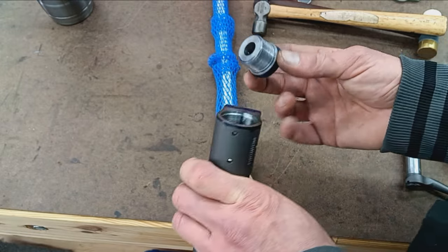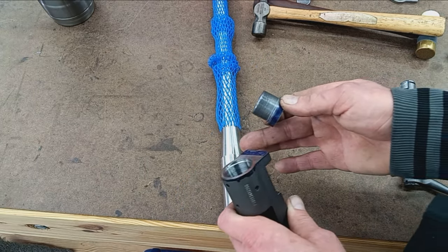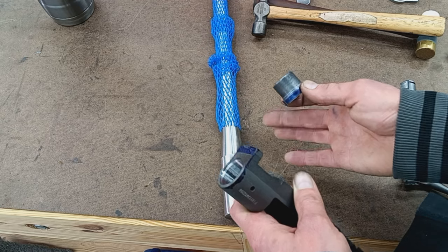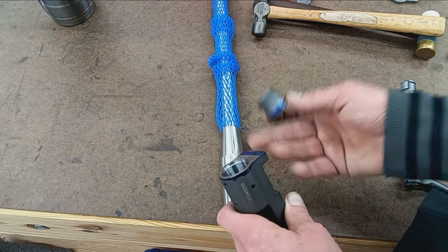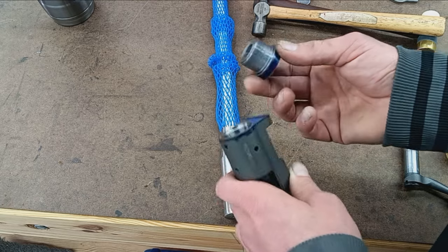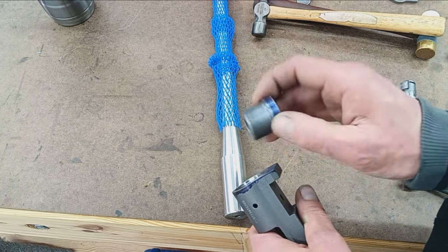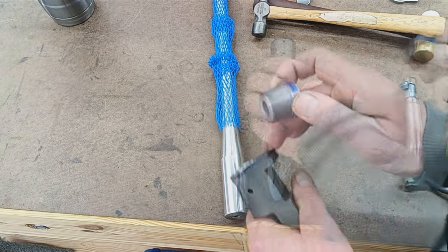If this was an untouched receiver, I would just go ahead and cut it to specification and everything should be fine. So in our case, if I cut this to 1 1/16, the thing would be so loose, it would be unsafe. So the whole point of this is to get a known diameter for our newly machined receiver.